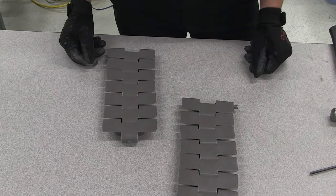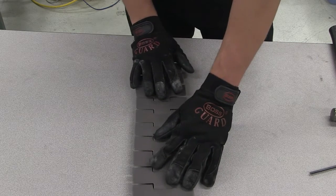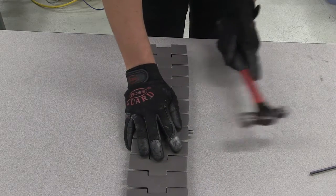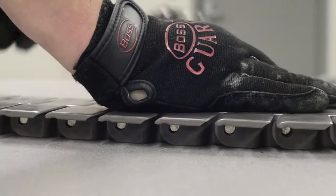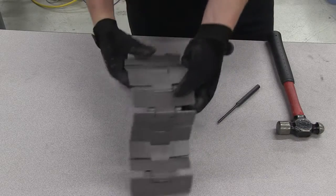To reassemble your tabletop one-piece chain, start by pulling the two end links together on the drive sprocket or using the chain assembly tool block. Take a pin and insert it into the hinge. Begin to strike the drift until the pin is centered and flush on both sides of the hinge.